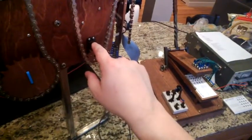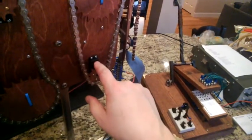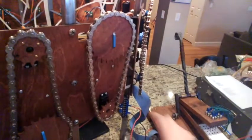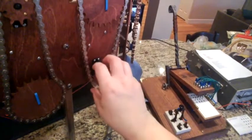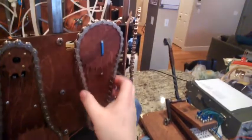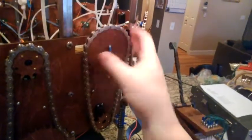By making the connection through the punch card, you're changing the timing constant on the 555, which creates a pulse width signal that goes to these servos. In their default mode they sit in the off position, but when you make the connection they go to their opposite setting — about 180 degrees away — going through a two-to-one reduction, which turns the valve 90 degrees: closed, open, closed. Pretty simple.